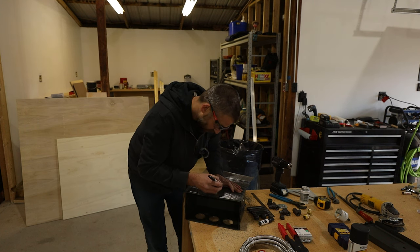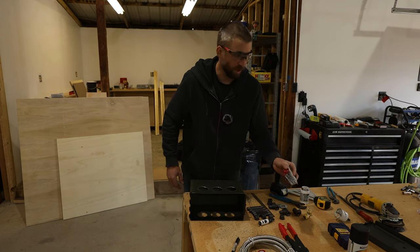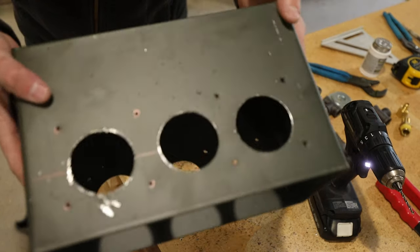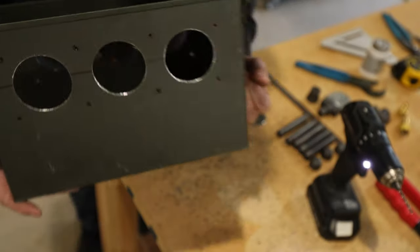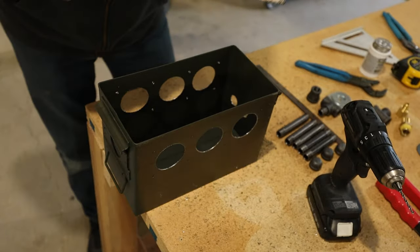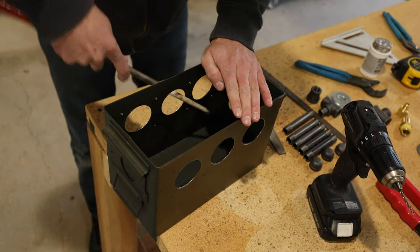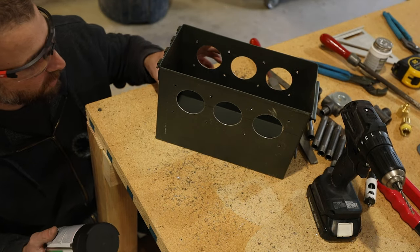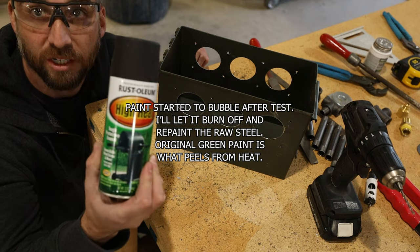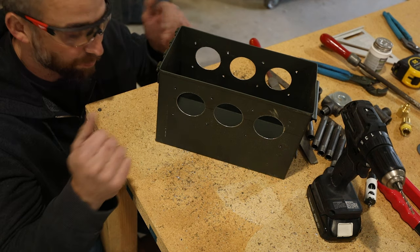Line up with the square and try to keep them aligned — same thing on both sides. I have an eighth-inch rivet so I'm going to use an eighth-inch drill bit and drill all those out so you can pop rivet the grate in place, so lava rocks won't fall through. Once that's done, take a rasp or file and clean up your holes so you're not going to cut yourself. If you want to paint it, I'm using Rust-Oleum high-heat paint and just rattle-canning it. Give it a day to dry.